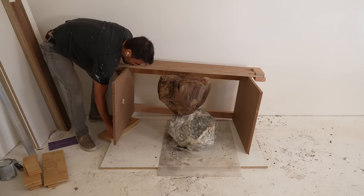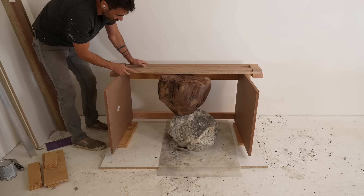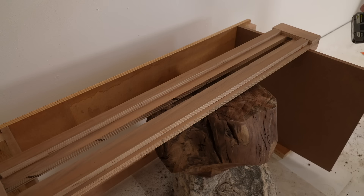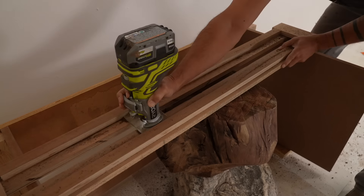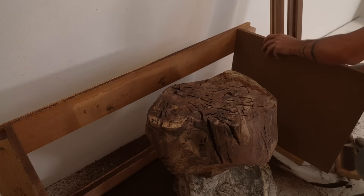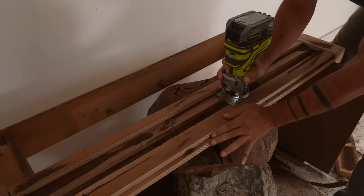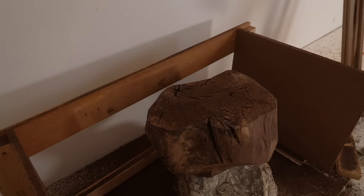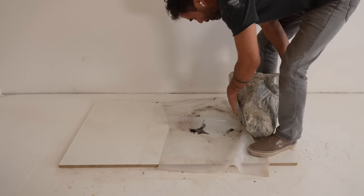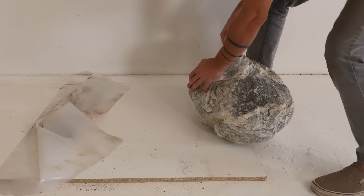Carving out a notch in the wood to fit perfectly onto the stone with a perfectly level top is a little beyond my skill set. So instead I'm going to level the wood now that I know its final position. I made a quick jig out of scrap that lets me use my very small palm router, sliding it back and forth across the top and slowly pulling out the shims underneath to decrease the height and work down to a level surface. Seeing how many cracks go deep into this piece, I was really happy I didn't try to slab it. The rock is now off the silicone—a perfectly flat bottom thanks to the anchoring epoxy, feels like hard plastic and doesn't really scratch floors.